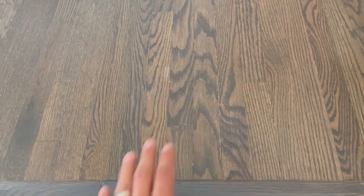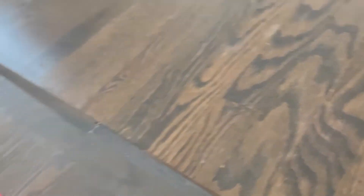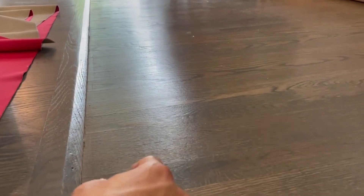You can see some of the old tones have kind of pulled back a little bit — they're not as noticeable. But catch the right light and you can see where there's no clear coat still. Next step: go to clear. If you're doing a larger area, give it a quick light sand just to get rid of any hairs. Next step is to put some polyurethane on — it's just a clear coat and it hardens. You're gonna want to find out if your floor is a semi-gloss or satin finish. Mine's a satin. Find out which one you've got — you can probably do that with the same sample chart from Minwax at Home Depot.